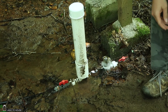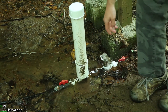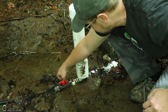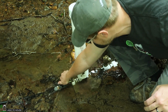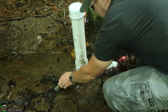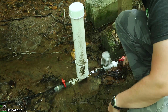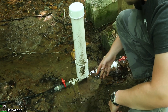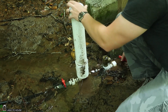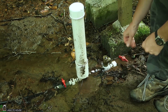To purge the air out of the tank, I'm going to stop both valves — the drive pipe and the delivery pipe. The reason I'm stopping the delivery pipe is to keep water in the valve going uphill, so I don't have to re-prime that pipe. And now I'm going to stop the drive pipe. There are concrete blocks in the way so you can't quite stop it, but that should be good enough.